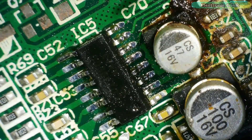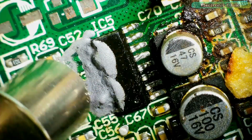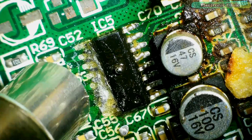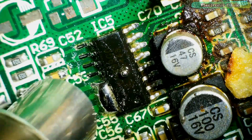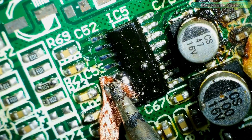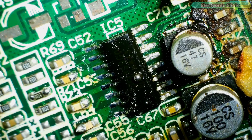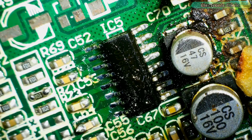When you finish soldering, clean the PCB. What happens if we apply too much soldering paste? Well, let's find out. As you can see, excess soldering paste causes solder bridges. To remove these solder bridges, we will use desoldering wire. The solder bridges have been removed. To be on the safe side, make sure you check for short circuits using your digital multimeter.